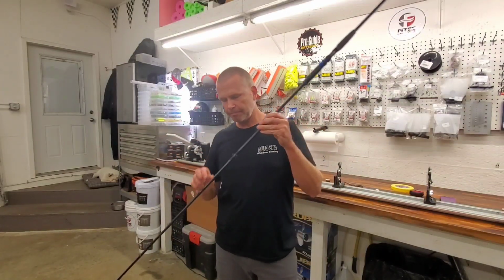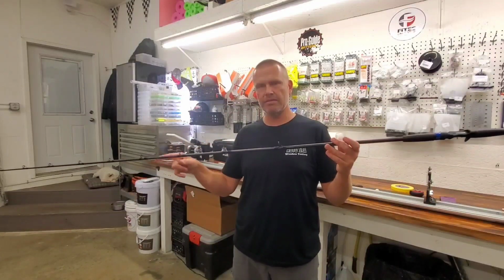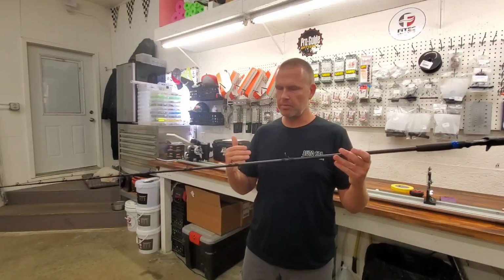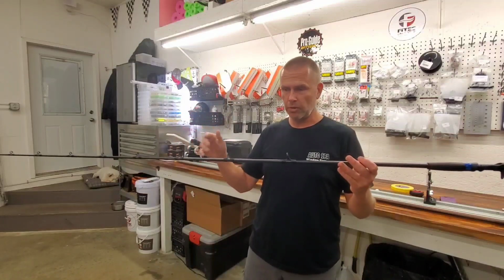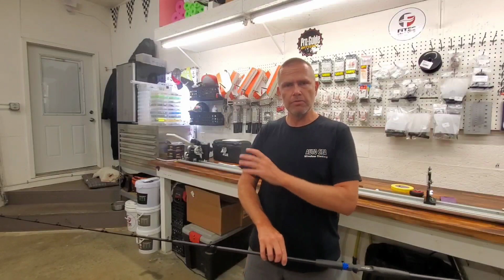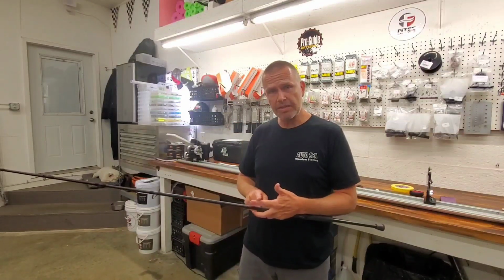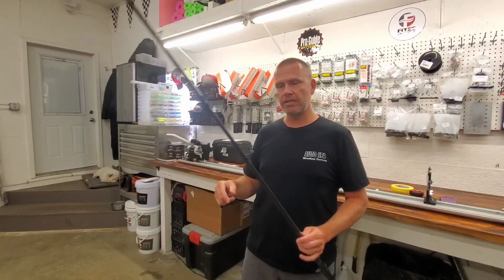So after that, because I will have handled it a lot and put a lot of stress on it, I want to check these guides and make sure that they're all clocked appropriately so they're as good as it can possibly be, so there's no torque on the rod when it's being used in the real world. So I guess tip number 1 for this video is don't start your epoxy process until you've thoroughly load tested it and then recheck your guide placement after load testing.